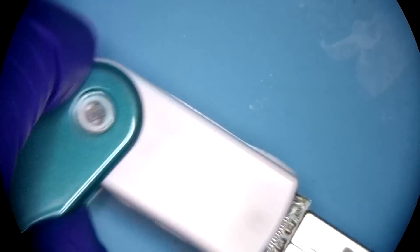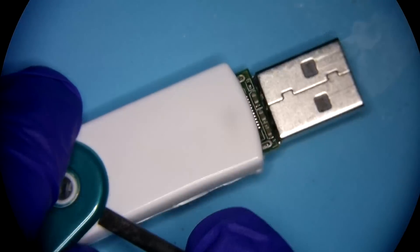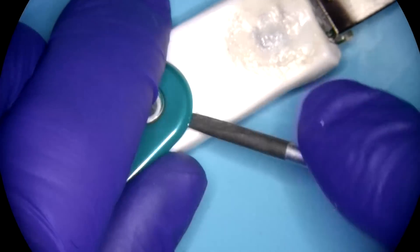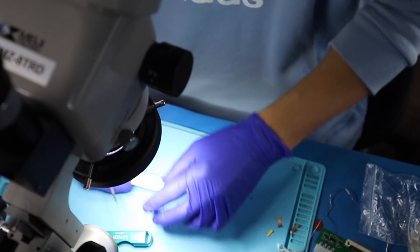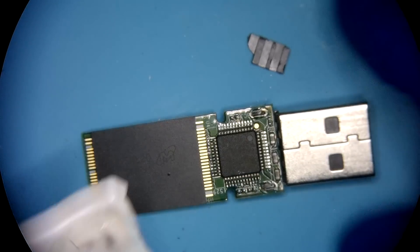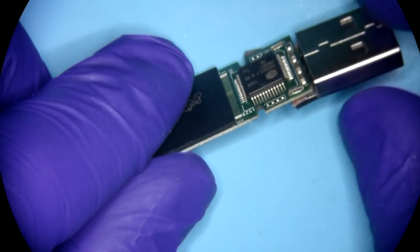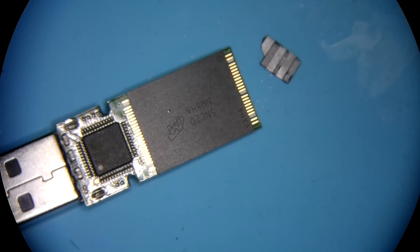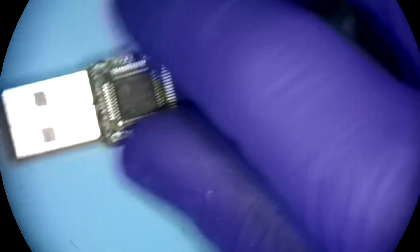Let's begin by taking it all apart. This is a really lovely design of Lexar flash drives — they've got two little prongs holding this swinging protector. The part that heated up and melted this plastic cover is this SM38 controller. It's exactly the same unit as the one I worked on last week.